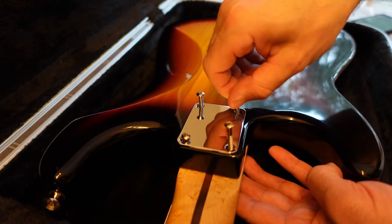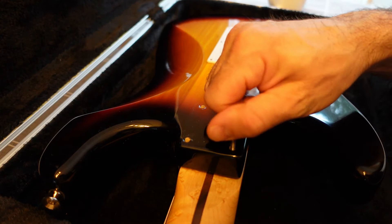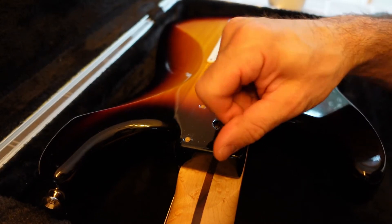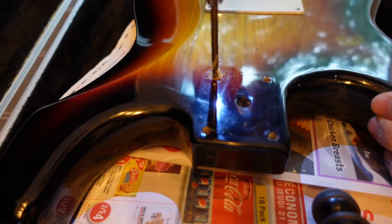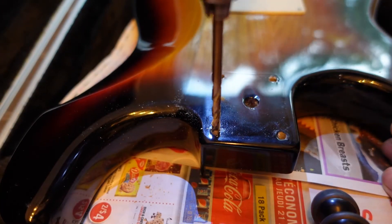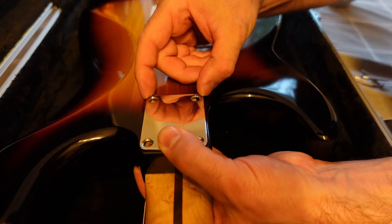You can see the holes in the body are tight — you can't just drop the screw through. My move here is to enlarge the holes in the body. The screw holes in the body don't need to be super tight on the screw; you don't have to screw them through the body. So I'm taking one size up on the drill bit and just dropping that through the screw hole to make it a little bigger, so the screws can drop in but still don't shake around too much. Just that little bit of play should give the neck the movement it needs.